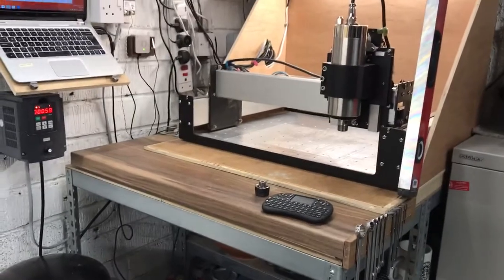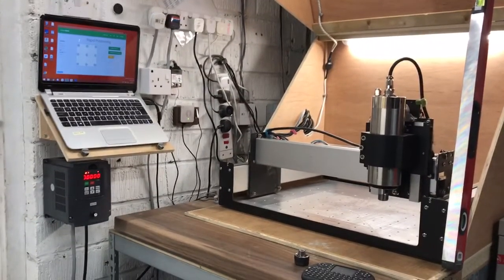It's got a bit more of an industrial setup now, more wires. I've still got my start and stop going through a plug socket just there - that was for the DeWalt. Now I'm not a hundred percent sure how to start the spindle using the automatic start. I tried wiring up the D11 pin with the ground pin like I do to my relay for the main spindle and it's not working. I've got a feeling I need to still use a relay with it, because it's actually a switch - I plugged a switch into the two pins you're meant to on the VFD and it worked fine. So I reckon it's a case of using a relay to turn it on and off, which will give it a speed reading.